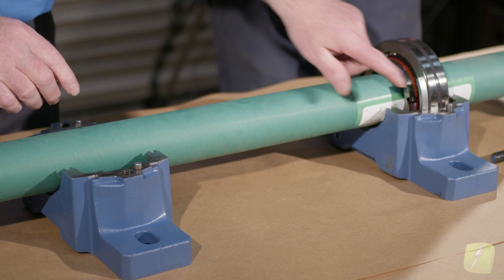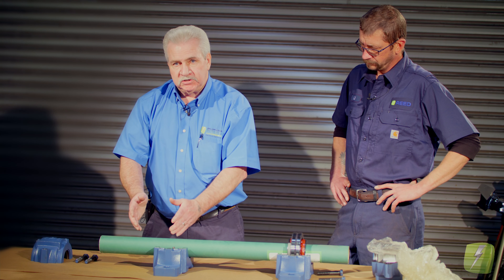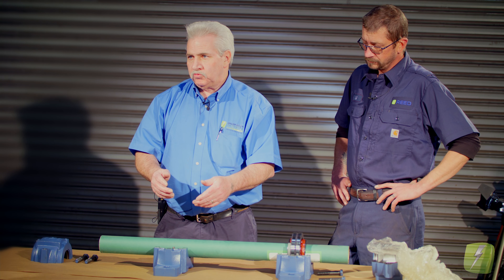That's pretty much exactly what's going on inside an electric motor that we're changing from a roller bearing to two ball bearings. We now have a ball bearing on this end of the motor — fixed so that it's clamped in the housing with the spacer, tightened to the shaft — and we want the other end to have room to grow. Calculating the thermal growth tells us the amount we need to machine out of the housing or the bearing caps to allow it to expand on one end, and not try to bend the shaft in the middle or preload the bearings to where they wear out quickly.